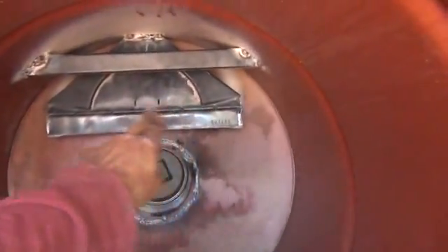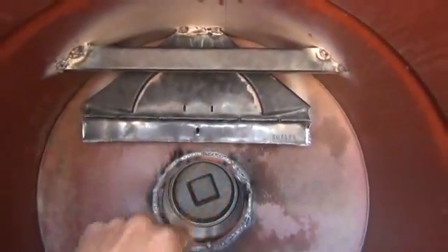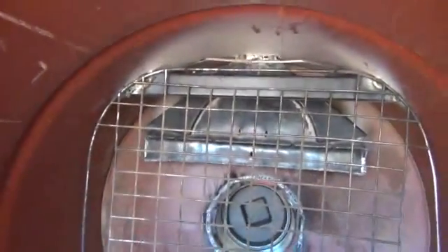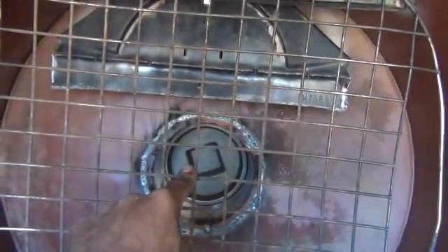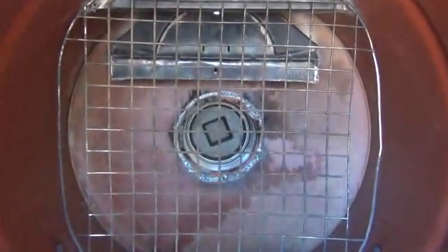I have a little excerpt video that I'll show you — what's going on behind that triangular plate in the back is our gas output, designed to make sure nothing can get in it. Here's our actual separation screen — that's why those braces are going across both at the top and at the bottom. That allows the screen to sit on that when the weight from the wood is on there. This will keep the actual wood mass away from the bottom of the barrel itself, allowing an open gas area for the gas to go out. And when we use this in updraft gasifier mode, opening that large plug allows air intake to spread all the way around the bottom of the wood mass or biochar and draw evenly up, creating a nice burn zone.